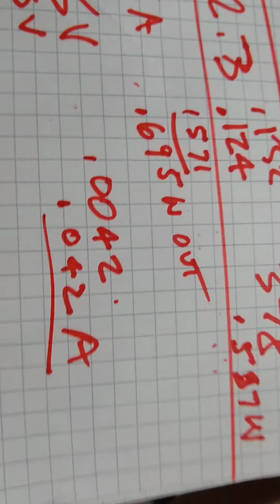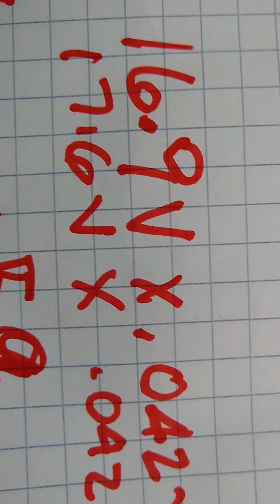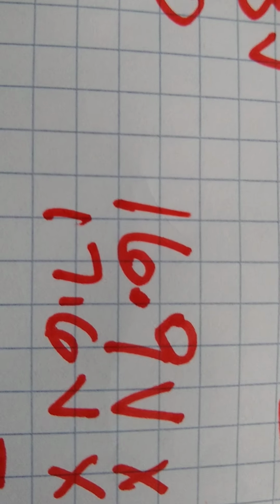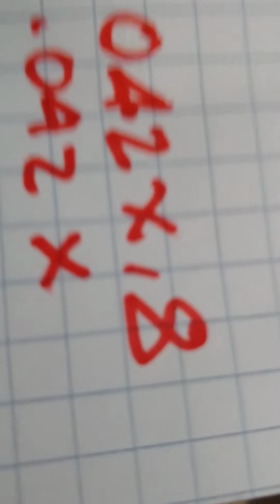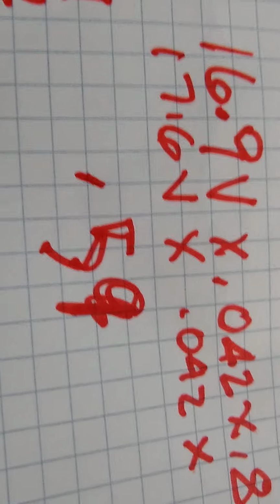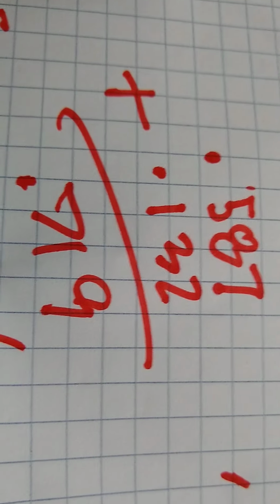So the watts with no cap at all is 0.59 in, and here we have it says it's only 16.9 on the scope, while the meter on the variac says 21, but that's what it says. So this is all scope, and then there's the power factor, 0.8. It's a 36 degree phase angle. And so it comes to 0.59 in and 0.719 out. This is with no cap.